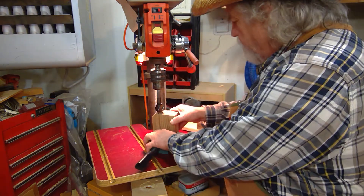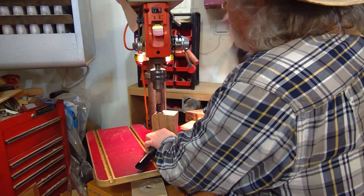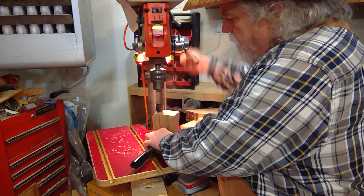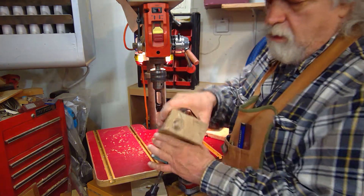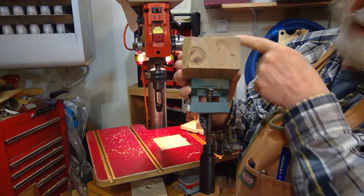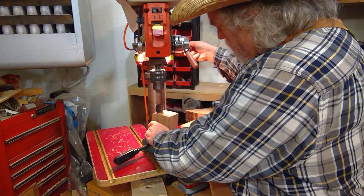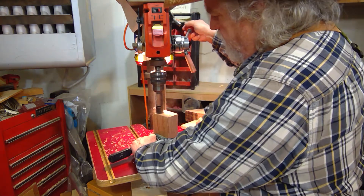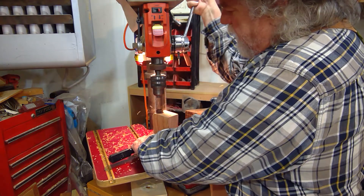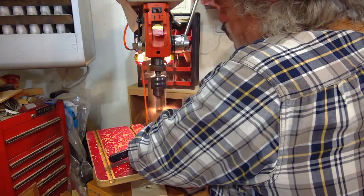So in this particular case, I put my piece in and lock it down onto my vise. I drew a pencil line on here to tell where that crack line is, and I can bring my dowel cutter in here. I'm going to drill down, but I got to make sure that all these fins do not stick out on the vise side. So I'm going to drill in this corner and end up with that crack not being part of the dowel. Let's go ahead and drill this first one out. I'll just drill one hole to show you. Slowly engage it — now I can see the outer perimeter of that hole, and I know I'm away from this edge. Now I just slowly drill it down, and every now and then pull it out and clean it, because there's a lot of chips in there.